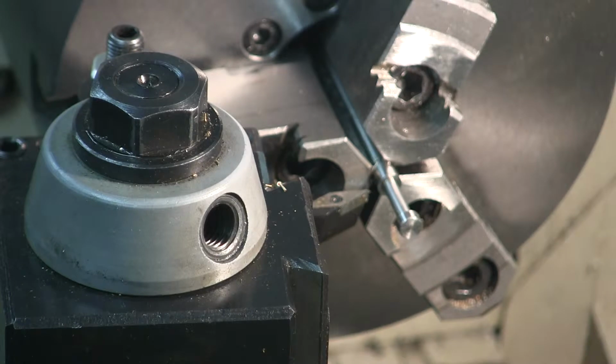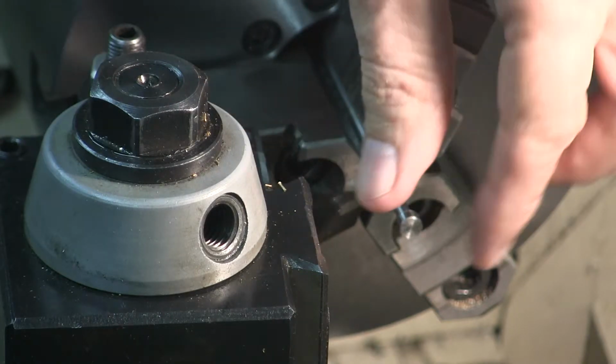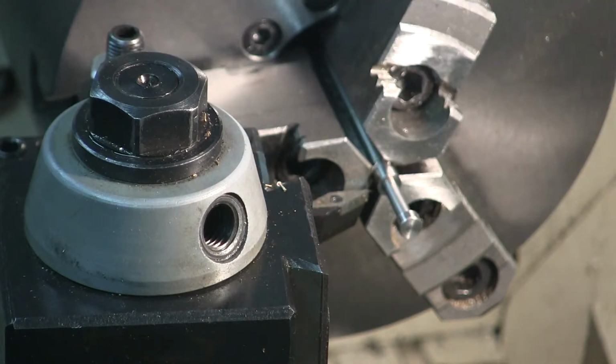I think I had the camera turned off the entire time I was talking to you and creating this cut in the valve. The cut is 600 thousandths long and it's below a 1/8 inch head. And I performed the cut with this parallelogram high-speed steel Arthur R. Warner insert. And I did some relief slots here and here so I could cut between them. Turned out well. Finish is good. The finish makes a little difference on this piece.